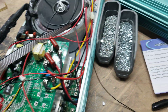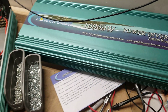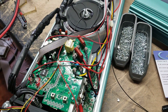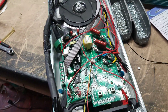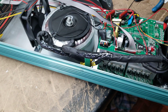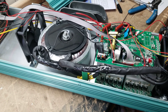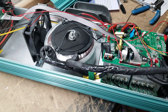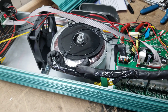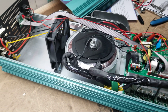This is advertised as a modified sine wave inverter, and when I picked it up I said 'damn, this thing's really heavy for a modified sine wave inverter.' So of course I open it up and lo and behold I find the guts of a pure sine wave inverter. This is a low frequency pure sine wave inverter because you've got your toroidal transformer right there.